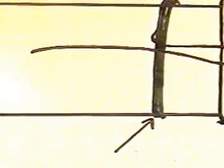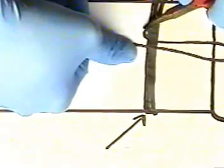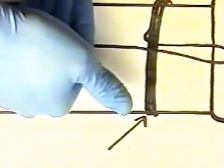This is an illustrated representation of applying the thread binding onto the bending rubber sheath over the bending section. Again, the first loop will be put underneath your thumb, as shown here. You will take your needle nose pliers and pull on one thread until this loop is drawn underneath the threads. You will feel which thread it is, most of the time underneath your thumb. Again, find the thread that will pull underneath the 3 to 4 bindings, and pull that until it goes all the way through, but not far enough that you pull the binding completely out.